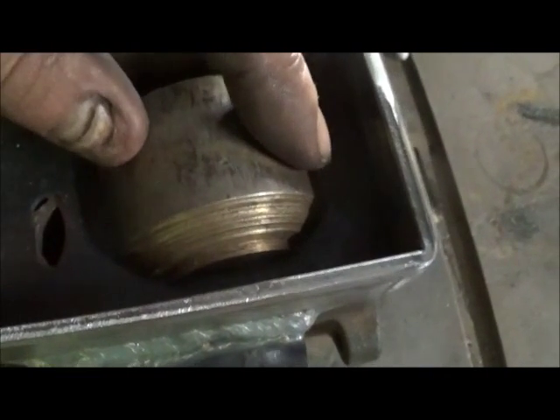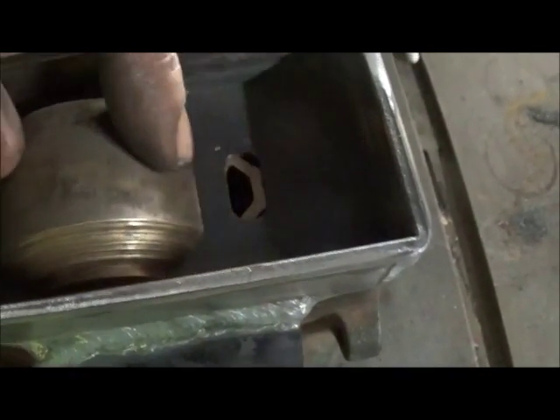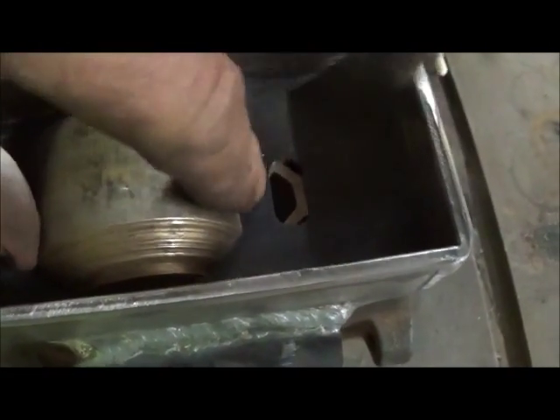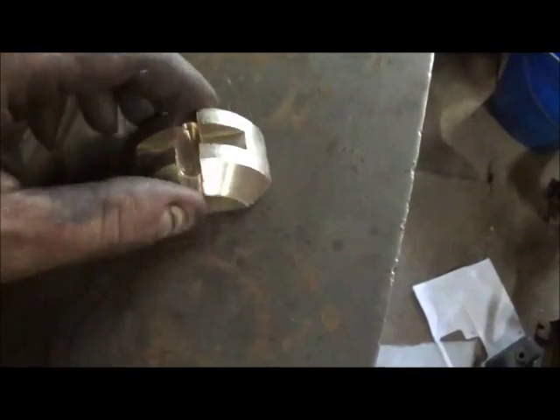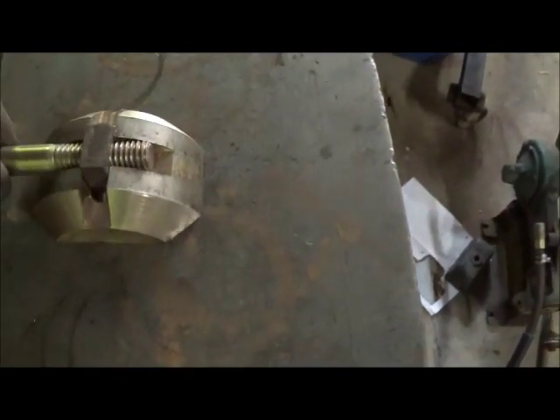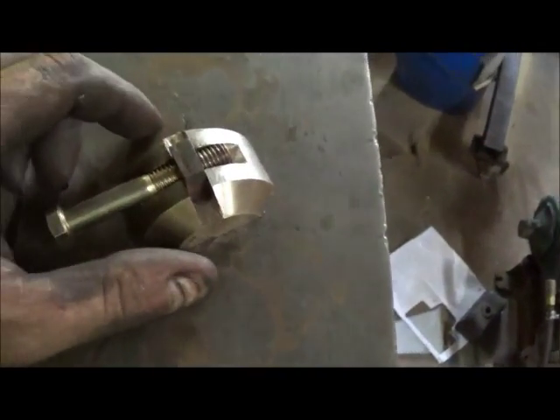I may just do it on the vertical and cup it out into a square like all the others I've seen. We'll do the top side first and see what we need to do on getting it hooked up. Basically it's just going to go back and forth and direct your flow — it's not complicated. We've got it machined the way we want it now: put a T-slot in it, cut the bottom machined out. This fits down inside — you can see the square nut holds it, and it'll go in the steam chest like that and just slide back and forth.